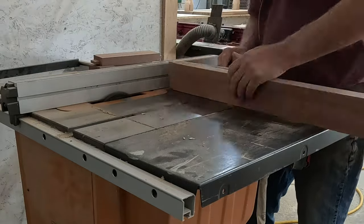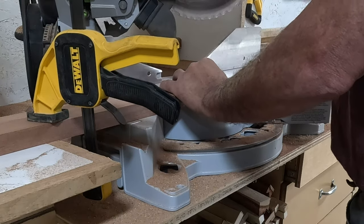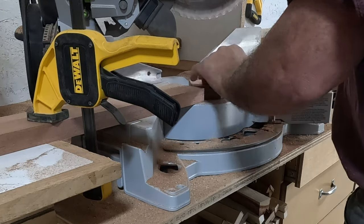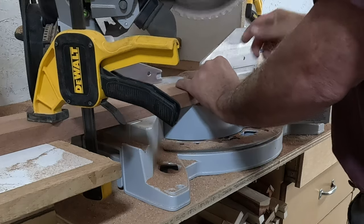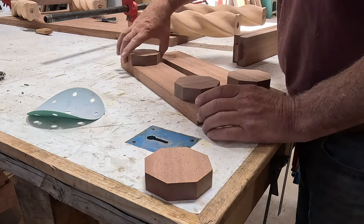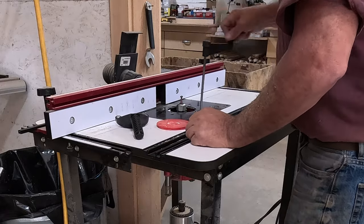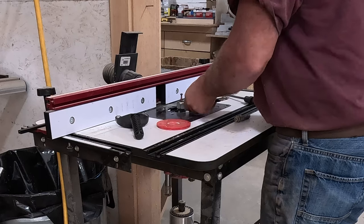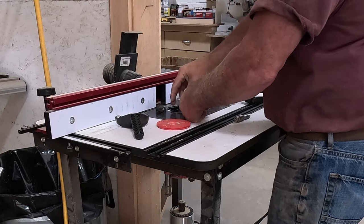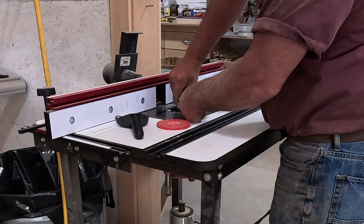I wanted to put a little detail on the bottom of this thing. I wanted to put a foot plate that went across the bottom of both legs and then put little feet below it, which are kind of in line with the legs. It was basically taking about a three and a half by three and a half inch block and turning it into an octagon like you see here. I was spacing them on there and almost forgot — these have to be lined up with the legs, otherwise the legs will come down to that foot block and that will look kind of funny. So I had to recalculate here and get that set up. I'm putting a little bead around the bottom of these feet. I'm going to call the long piece that goes from leg to leg the footboard, and I'm going to put a bead around it as well. Then I'm going to nail the two together and assemble them to the actual table. The bead bit is in and I'm just determining the type of bead I want and the height I want it at — that's whatever you want to make it look like.